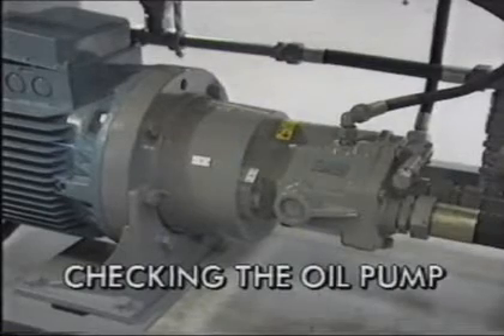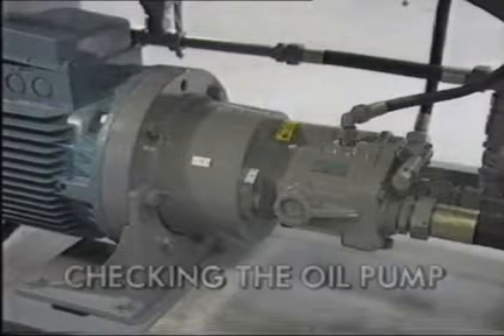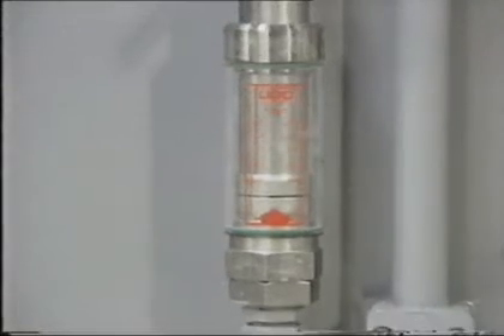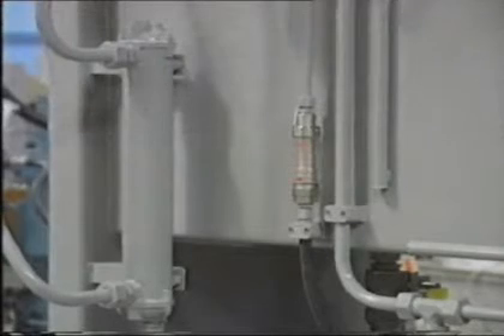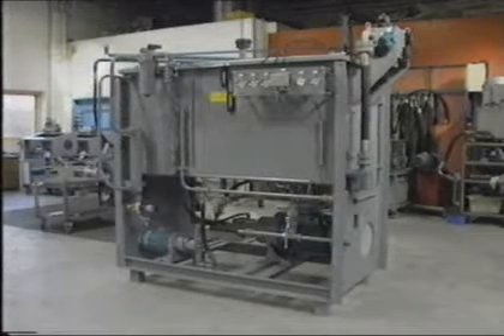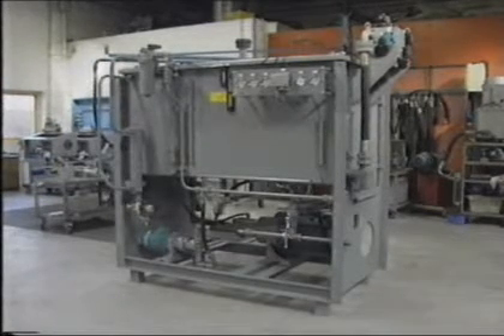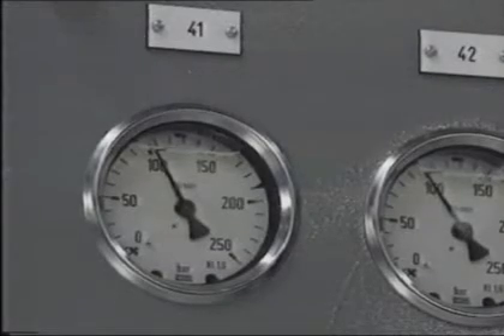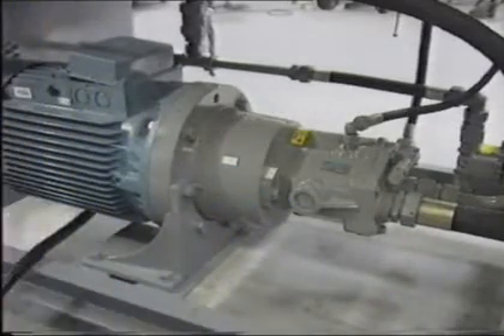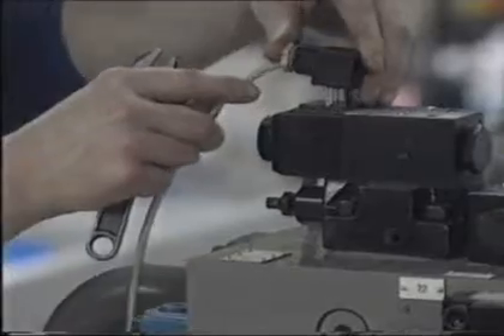The high-pressure oil pumps have to be replaced or overhauled if they are unable to maintain the necessary pressure. A first indication that the oil pressure is not high enough is an increase in the drain oil volume as measured in flow meter 14. The delivered pressure from the pump is read from manometer 41. This pressure can be adjusted by turning the pressure compensator, which is at the side of the pump. The pump should be capable of delivering 200 bar, but this pressure cannot be adjusted to be higher than the setting which has been selected on safety valve 58.